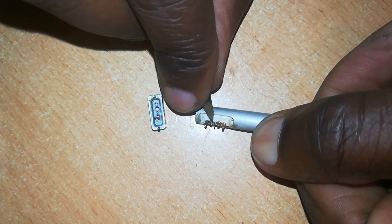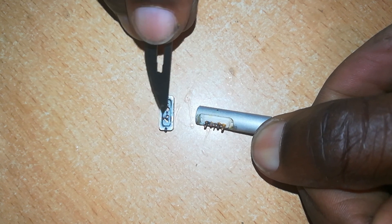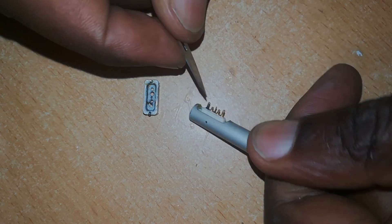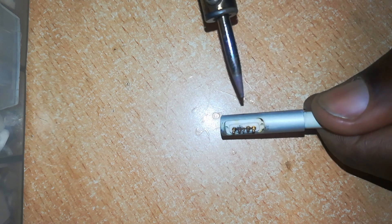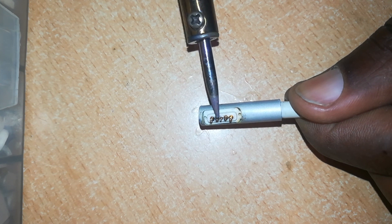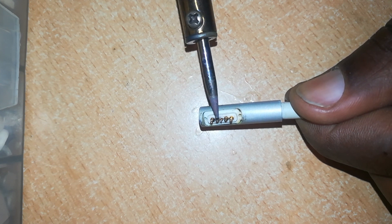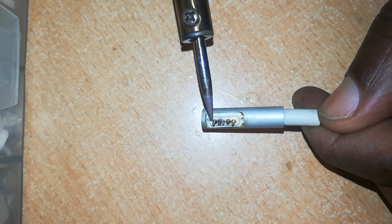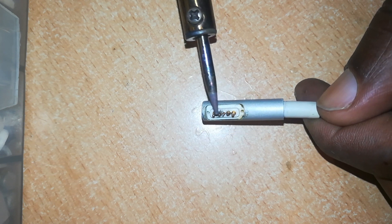One of them springs back out but the other one is stuck. There's some plastic stuck to it which came from the inner plastic portion of the connector. Now with these burnt pins, it tends to be plastic which has melted and gone into the holes where the pins go. The first way to fix it is to scrape along the pins and remove all the plastic stuck to the side until the pin is smooth, but be careful not to make the pin loose or bent.